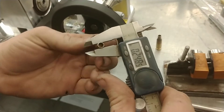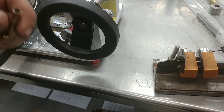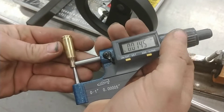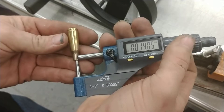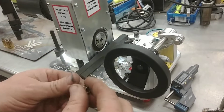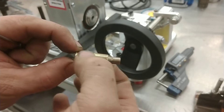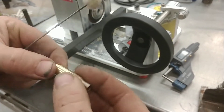I'll show you a non-expanded 220 Russian - you can see it's basically 248. Once they're expanded, 270. So if you look at our thickness before we start: 14.5, rotate - 14.0, rotate - 14.03, 14.6. You can see after expanding it's not real consistent on the neck thickness. Now this is 220 Russian, not 6 PPC yet, so it's got a lot of body taper.